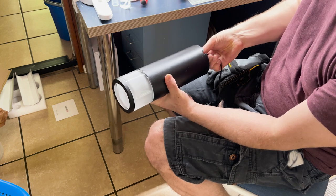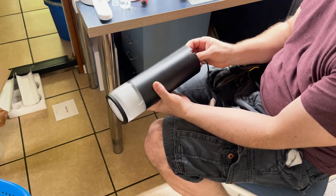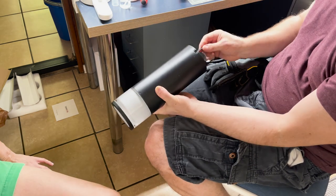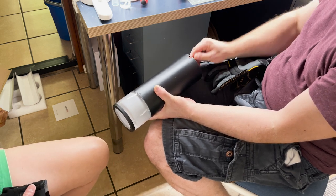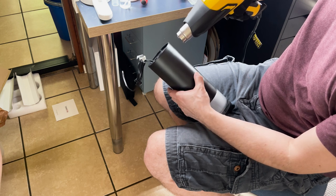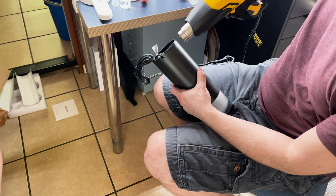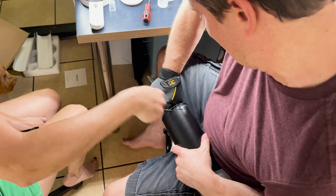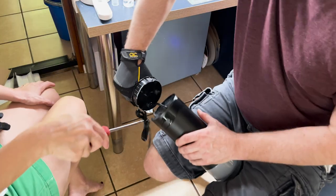So once we got the lights, it was time to take them apart. I enlisted my wife's help to get these opened up so we can install our own RGB LEDs. I will link another video in the description that gave us some great insight into how to open these up as well. For us, though, the process we found that worked the best is to use a heat gun to get the silicone inside softened up. We then use a combination of spraying alcohol into the openings and then gently prying to work the bottom cap off. They get easier after you do a few.